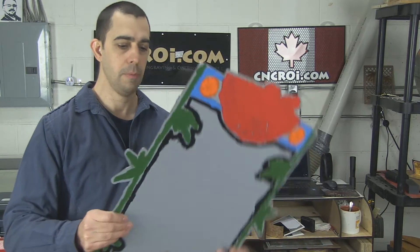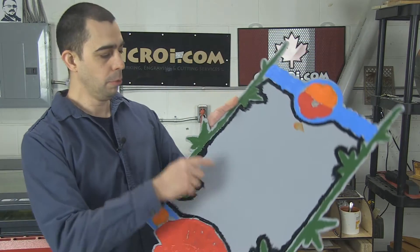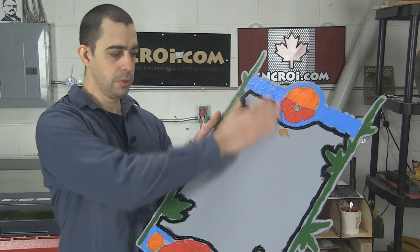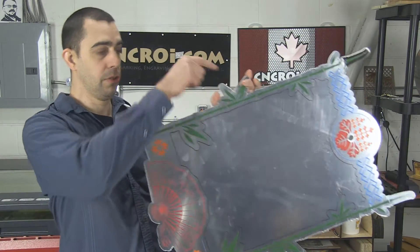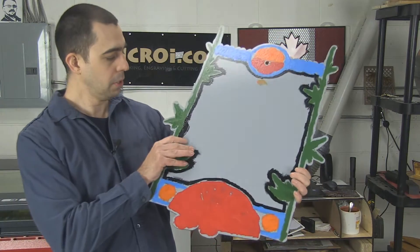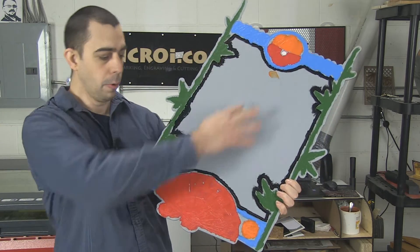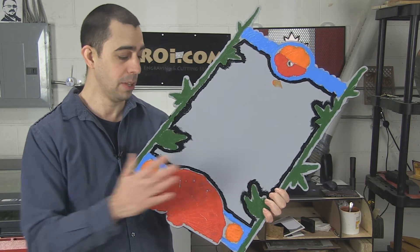What you saw just now, before the profile was cut out, was actually the laser removing the layer of the mirrored material itself off the acrylic. That's right on the back here. So what happens is, if I didn't do the paint filling, you'd actually see straight through this. The nice thing about the laser is that you actually have a bit of a hole generated everywhere where the engraving happens, so that's a perfect spot to put in the paint.